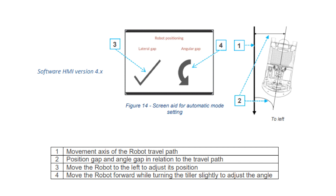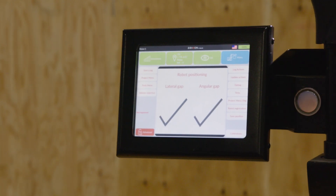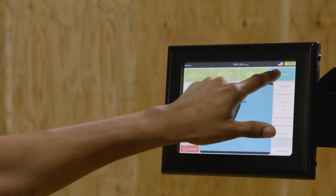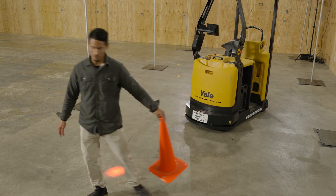To aid accurate positioning of the robot on the circuit, use the indicators available on the screen. The size of arrowheads is proportional to the gap from the circuit, so the robot must be moved or turned in the direction of the arrows to approach the circuit position. Adjust the position left-right before adjusting the angle. When you have ensured that there is no danger present and you are ready to launch the robot in automatic mode, press the menu button twice. It is colored blue and displays Menu for manual mode. The robot is now in automatic mode. The touch screen is green, displays Run, and can perform the tasks assigned to it. Before launching automatic mode, the operator should ensure that there are no persons or obstacles in the robot environment that may hinder automatic startup of the robot.